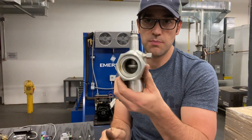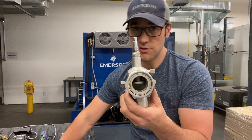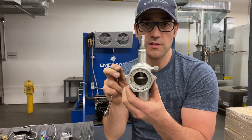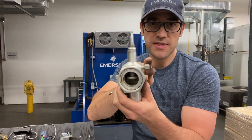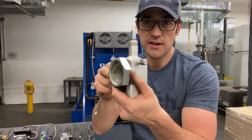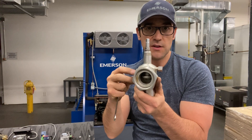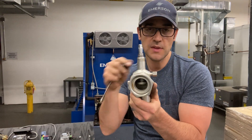There's other valves like this one that has two ports on it. Same thing — anytime you're opening a valve, use the proper loosening, loosen up the packing first, and then adjust them. What you need to be aware of with these ones though, there's always a fitting that's always open. So this is all the way back seated right now. This one here is closed off — so you put your gauge on this one. This one here, it's hard to see, but this one's still open. So you don't want to put it on that one. If there's nothing on it, usually there's a component could be on here measuring low pressure for an example — but make sure of that.